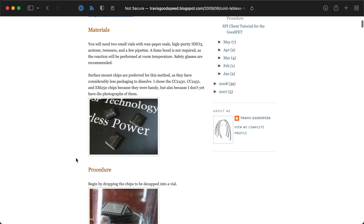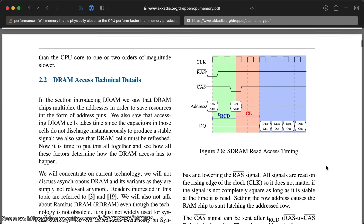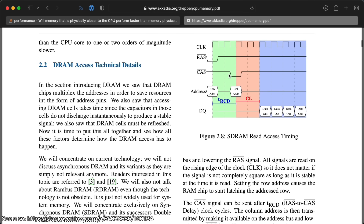I really wanted to see how it looks on the inside. There are two things you can do to see the inside of one of these chips — you could try dissolving the chip's casing with some really nasty chemicals, but I told Jeff no. So I did the next best thing: blasted it with some X-rays. Here's an X-ray of the Pi Zero 2 from an angle, and if you look really close, you can see the two layers of leads — some heading down to the bottom die and others up to the top. Pretty cool setup. And technically, the RAM is closer to the CPU here, so data access could be a fraction of a picosecond faster, but with the way LPDDR memory works, that doesn't actually make a difference.